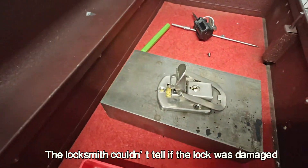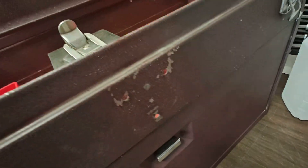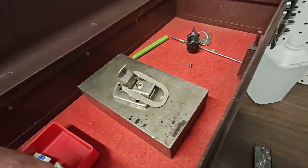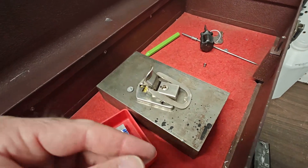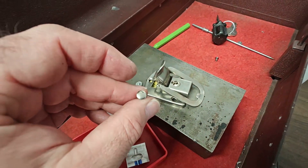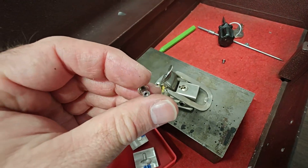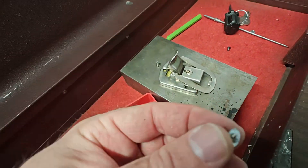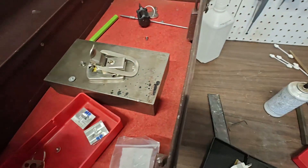As you can see, I'm just using a big piece of steel as a buck right there, or a dolly, to flatten those out. I took it off of there and was having trouble finding similar tubular rivets. So what I'm doing is I took the existing rivets, faced them off, tapped them, and I've got these teeny tiny screws that go in there.